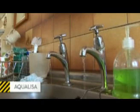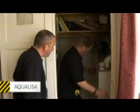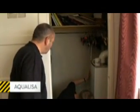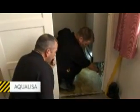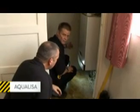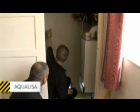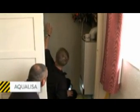Next step is to plumb the processor unit in. Have you sussed out where we're going to run the pipe work? This pipe at the back, that's the cold main. All right. Right, let's go down to a filling loop. Underneath, that's the hot, going down feeding the bathroom and downstairs. Right. So what we'll do is we'll tee in under here, and we'll run it back to this back wall. Yeah. We'll take it along low level, we'll come vertically up. We'll set the outside pipe over to pick up onto the digital unit there.